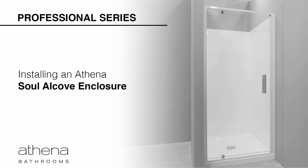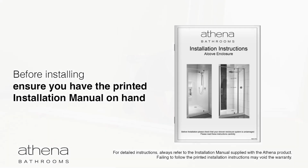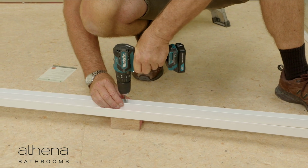In this video, we'll cover the essential steps and best practices for installing an Athena Soul Alcove Enclosure. Before installing any Athena product, ensure you have the printed installation manual on hand. Begin by drilling 3 evenly spaced holes into the V-groove of the single-piece door starter.